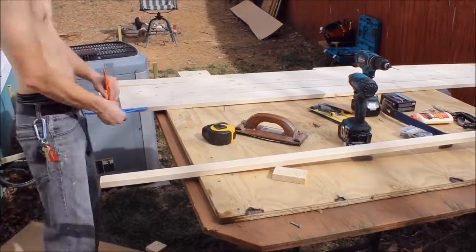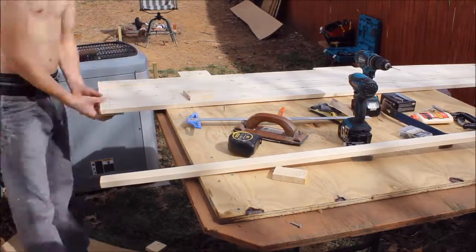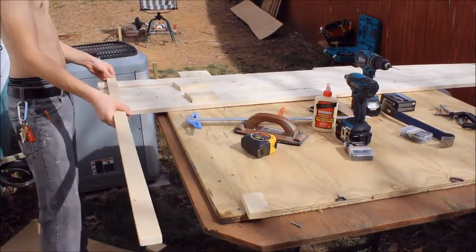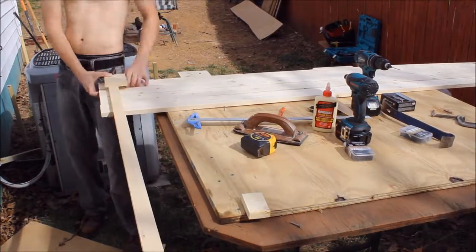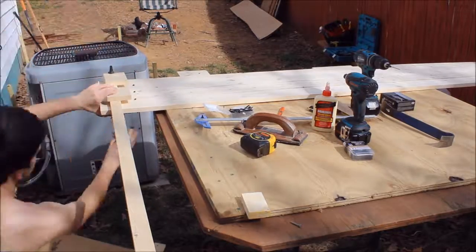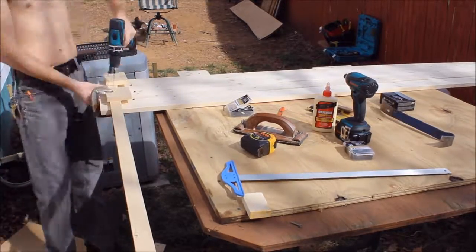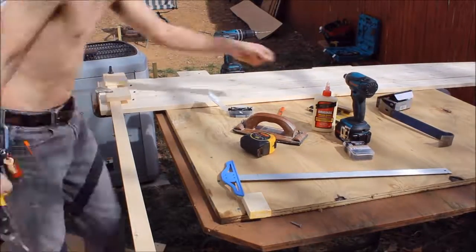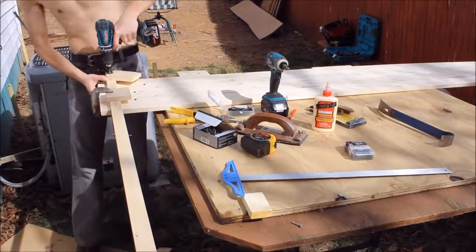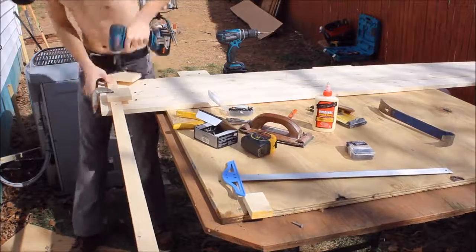To line them up, put a reference mark on there, put some glue on there, get your board in position, clamp one end down, put all your spacers in, clamp the other end down, and now it's ready to be piloted and screwed. There are many different techniques you can go with when doing something like this for how you're going to hold your piece in position and make it line up properly.